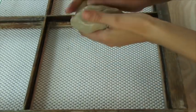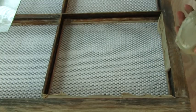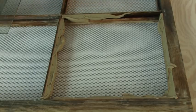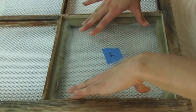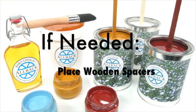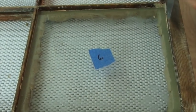Now it is time to back bed the windowpane. When back bedding, the putty needs to be very soft — massage it in your hands until warm and easy to manipulate. Cut putty with a putty knife and, with a pressured gliding motion, lay the putty along the glazing grooves. The goal is to avoid trapping any air bubbles. Place the correct piece of glass into the bedding of glazing putty, shimmy the glass back and forth carefully, and press down gently. Old thin glass tends to be very brittle so special care is needed. If necessary, take a cloth and press back and forth gently in all four corners. Trim away any excess putty, and use prepared wooden spacers to act as shock absorbers so the glass does not shift — press them down with your putty knife.